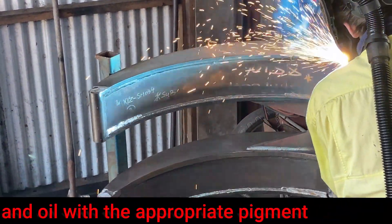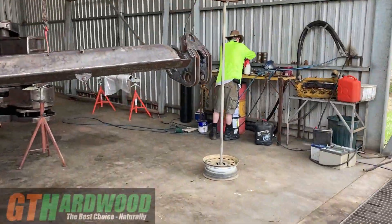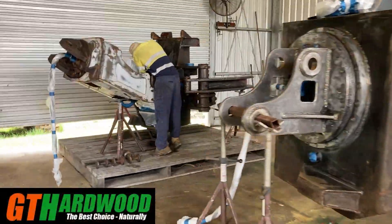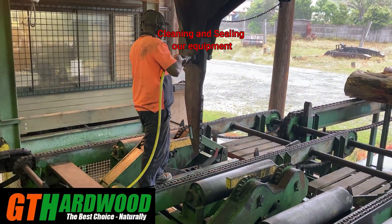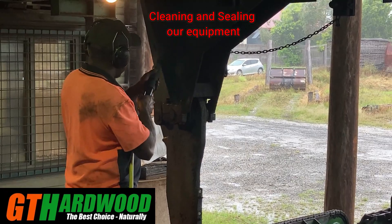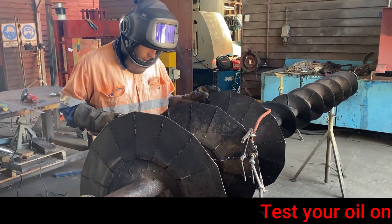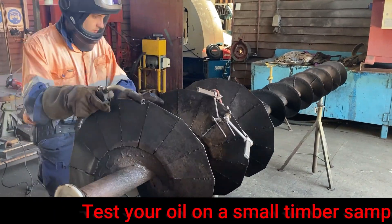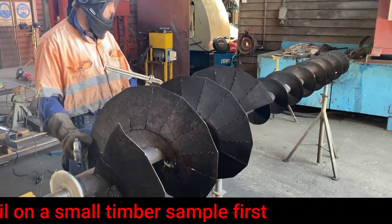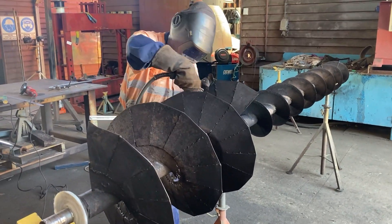The second scenario is that you use an oil with a pigment of whatever colour you're trying to achieve. Either way, you should apply an oil as soon as possible to seal the timber. There's a large range of decking finishes out there — read the product description carefully before using it, and always test the oil on a few pieces of timber before you do the whole lot.